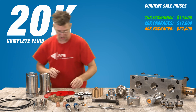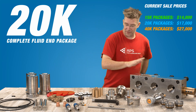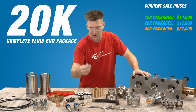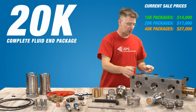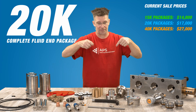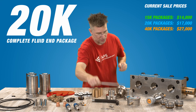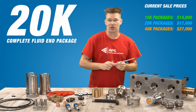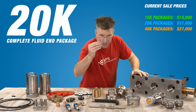I forgot to mention the deflector pads — you're going to get three of those. Once we get into the things that go on the bottom of your manifold, the first thing up is the trunnion rod. Once this is bolted up to your power frame, you're going to connect your trunnion rod to the little wings hanging on your power frame. This bar goes through there — this is what allows you to unbolt your manifold and swing it down out of the way to do your replacements for your stuffing boxes. You get a trunnion rod, two of these, and a couple of little cotter pins to go with that.